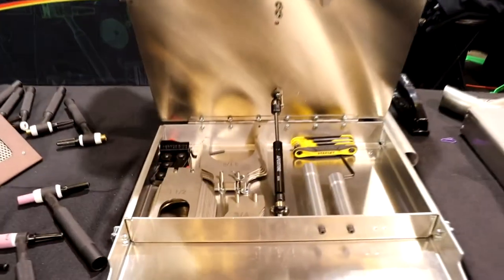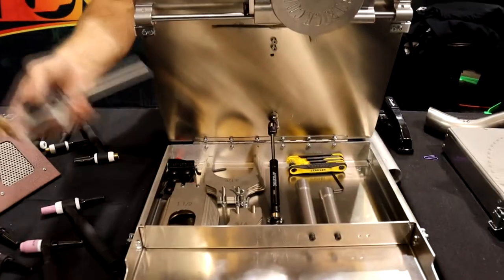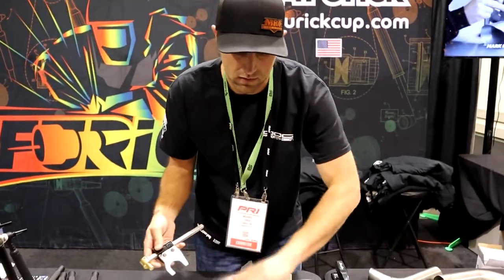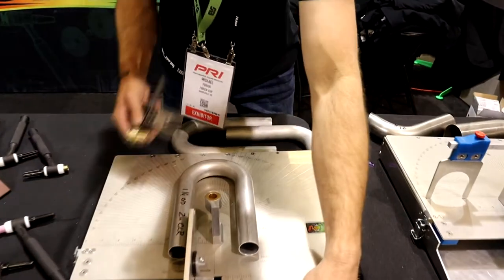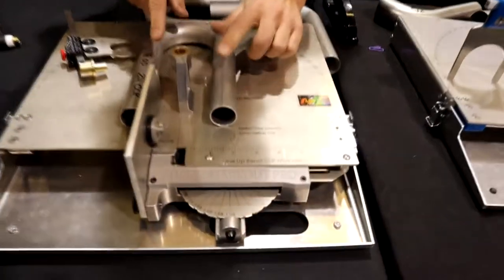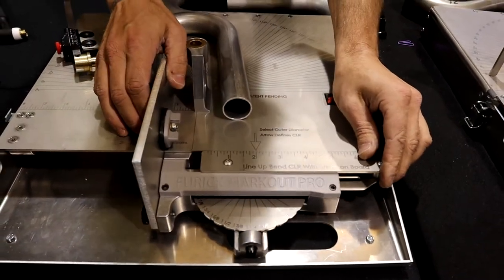You get your whole card cassette file in all different diameters. So, for instance, this one is 1 1/4. Your tube diameter, you set it with the dial. And you get 4 of these, and your centerline radius, you set it with the arrow. You get 4, so if you break one, it won't feel too bad.